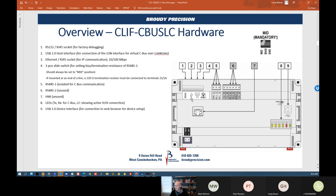There's the Ethernet connection RJ45 on the side — that's to get it on the network to be able to talk back to your Niagara device, in my case the Cypher 50, or a Web 8000 or a Supervisor. You have bus termination resistance with a switch; it's always set to mid, which is what's needed for this device to work. Then we have the first 485 port — that's what we use for CBUS communications for the 485. The second port is not used at all. There's a front HMI jack that looks like an RJ45 but that's not used either. You'll see transmit and receive CBUS LEDs, plus power and status LEDs.